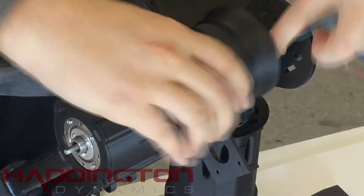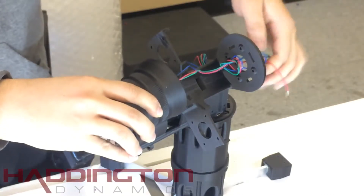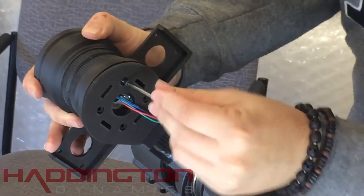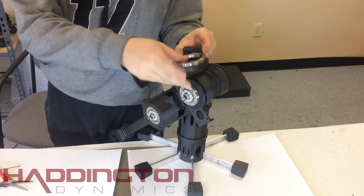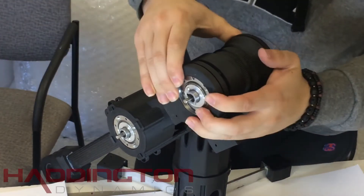Take your external gear and look for the side with the wires coming out of it. You want that side to match up with the bottom of the external gear mount. Feed the wires through the hole on the mount and line up the holes for the nuts with the holes on the back. Then, take four M3 by 12mm socket head screws and tighten them in the same X pattern from before. Take the external gear mount top and press a 6810 bearing into it and make it flush. Once you've done that, fit it over the stator gear. It should snap on.